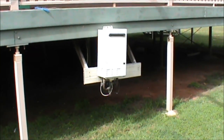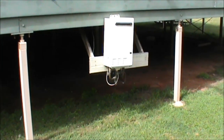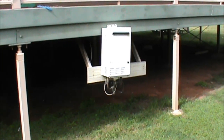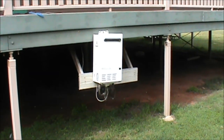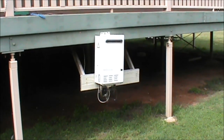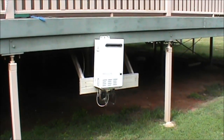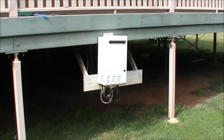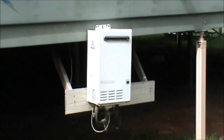The length of the hot water pipe runs under the house to your various water appliances means that when you turn on a hot water tap or a shower head, the pipe under the house has cold water sitting in it. When you turn the tap on you've got to wait for that water to come through before the heated water — either from the solar system or the gas backup — starts coming through the tap. On a house like this there's an awful lot of water in the copper piping that just sits there cold, and you've got to wait for the hot water to come through.